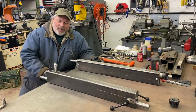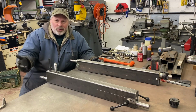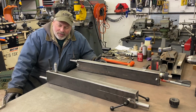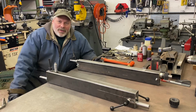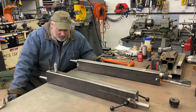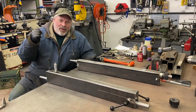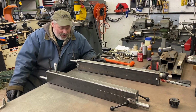So, my springs that I use in the front and these cone washers, I was impressed. Monday, I had to go to the transfer station, so I stopped by a local hardware store and set myself loose in the hardware aisle. I got some short M10 1.5 Allen heads for the front to hold the die on, and also for the other bead roller. Those are $1.45 a piece.